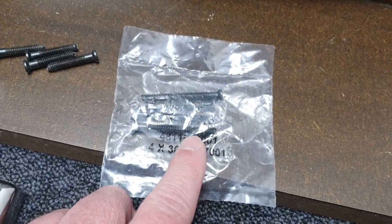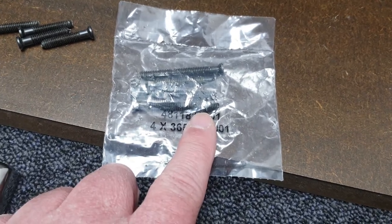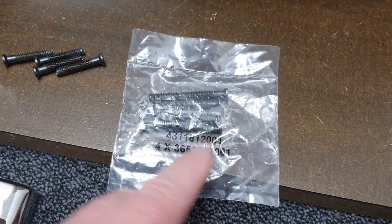You'll need to cut them down, and it definitely won't be at the pre-marked notch — you'll need the screw to be a bit longer, so you'll be cutting it on the thread. Do that very steadily and carefully with no rough edges, or it won't engage in the internal thread on the cylinder.